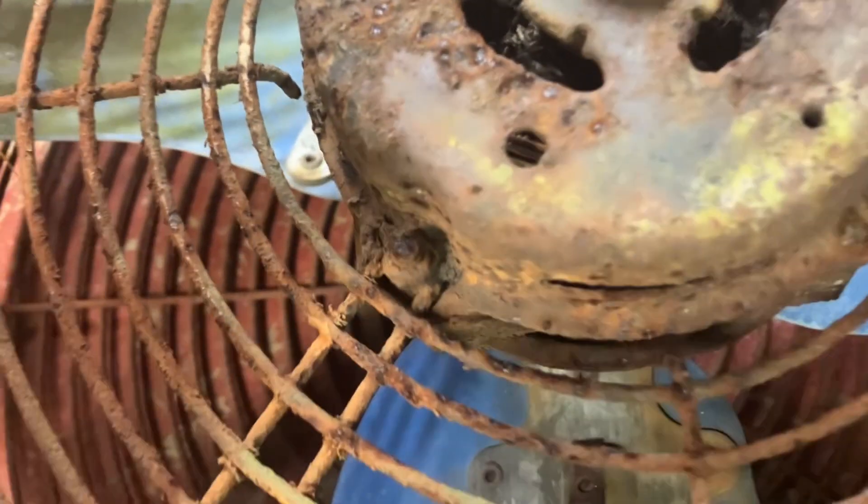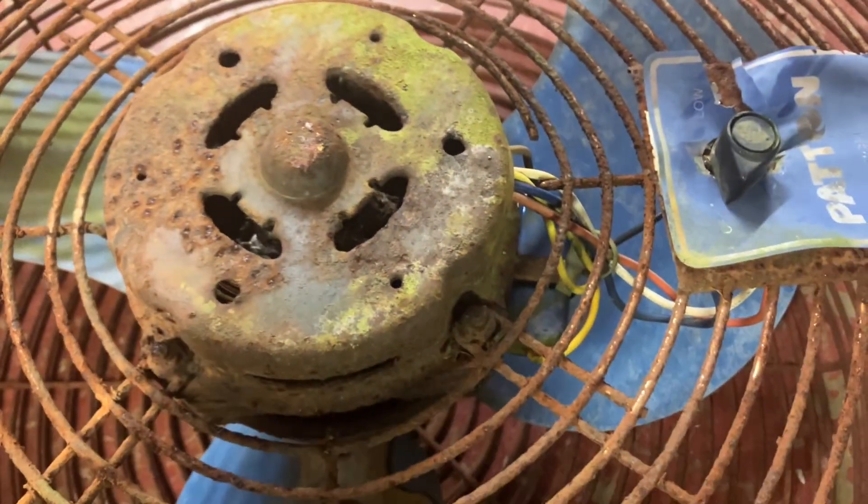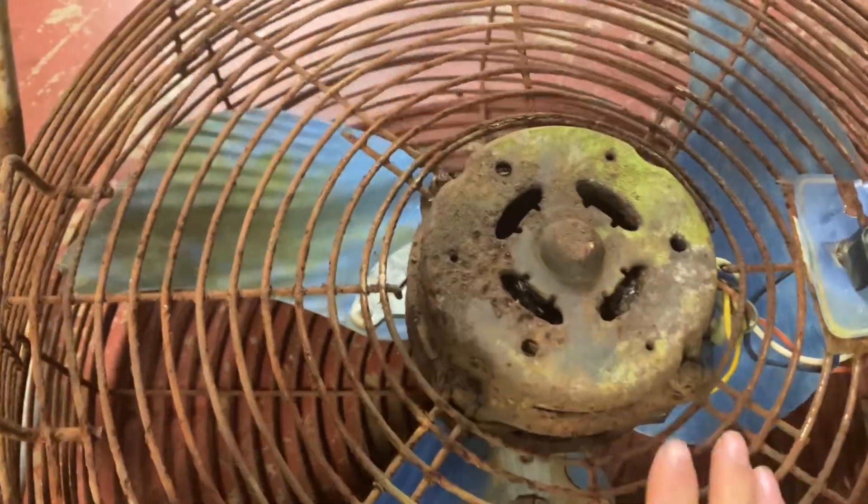What does give me maybe a bit of hope is that if you look down in there, you can see the windings are still getting bright. And I did a resistance check and it all seems to check out. So — might run? Not sure.